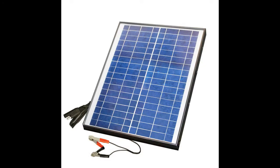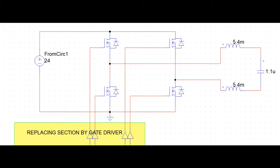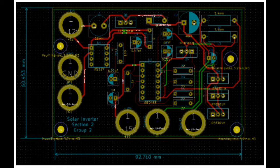The PCB that we designed consisted of a DC input of 12 volts to simulate a solar panel, and showcase boost conversion and an inverter for DC to DC step-up voltage and DC to AC conversion. Within this project, our goal was to use the power from a solar panel to light up an AC LED light bulb. However, instead of using a solar panel, which would have required a complex closed-loop control system to keep a consistent output current, we used a DC power source to give the input voltage that we would have received with our solar panel.